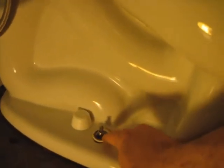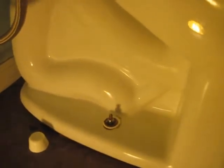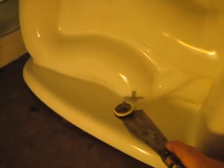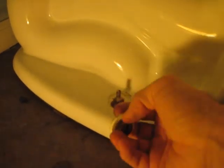Okay, with the flush bowl removed, now we put our attention to the main bowl. And again, these are the hold down nuts, washer, and this is the hold down bolt there. We took off the cap, and so we're just going to take a little crescent wrench and take these off, and these are on both sides of the toilet. And then with the nuts off, I'm just going to take my little putty knife and kind of scrape these off, and I'll just keep that like that.